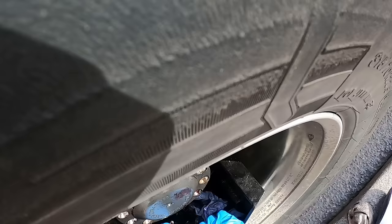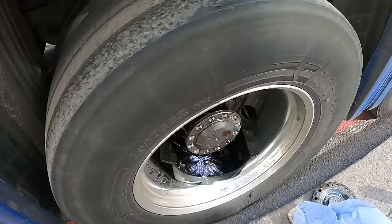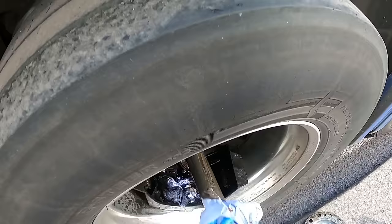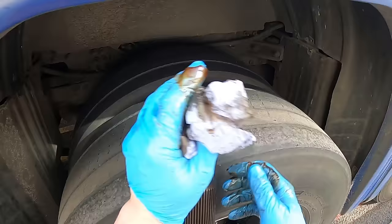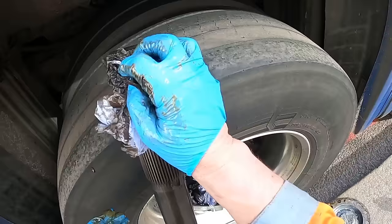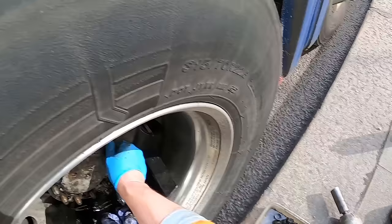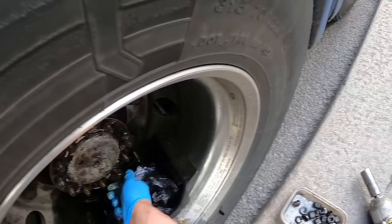Horrible stuff, this is. Lost me a little collar right down the bottom there. Here it is. Right. Two splines on here, which normally corresponds to a diff lock, but not on these coaches. So you can pull out any shaft and refit it easy enough. A little bit of juggling to get it lined up. Just put my half shaft cover here, stop any oil leaking out.